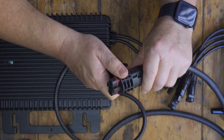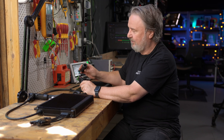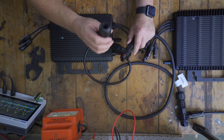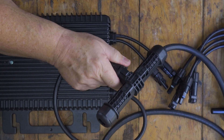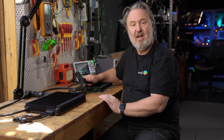Truly plug and play. The home run cable — there's going to be a circular cable going back to your main switch for the inverter system — we just pop that on there. You can't put it on the wrong way. Done — I've just built myself a microinverter system. Plug the panels in and off we go.